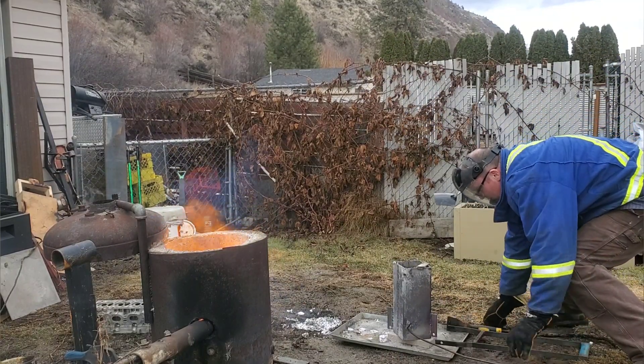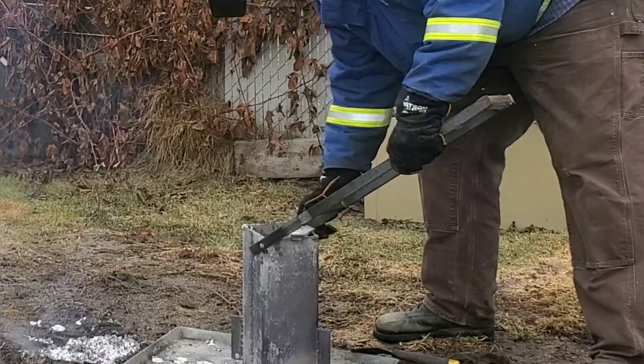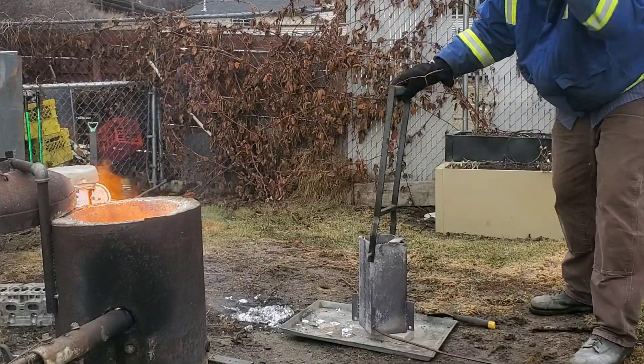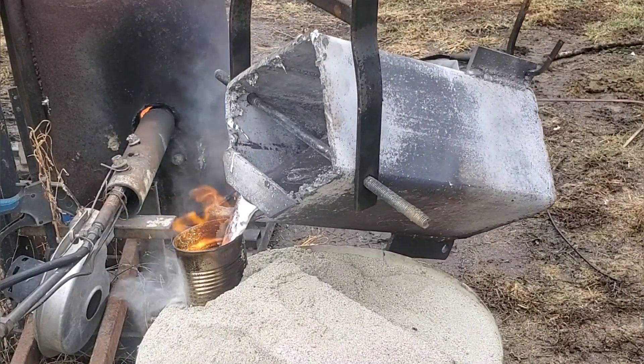The crucible I'm using is a metal crucible — there's actually a video on it. They're not exactly ideal and some people say they're dangerous, but I'm ready to accept the risks that come with using it. I've got a good wind coming from my back, so that's the direction I'm going to come in from, because there's going to be a bit of off-gassing from this pour.